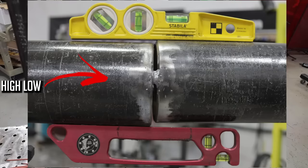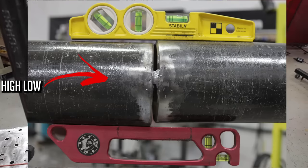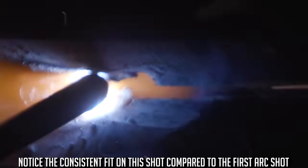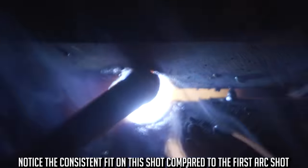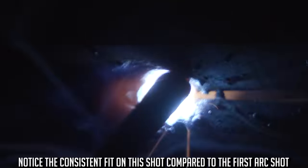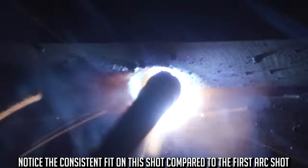Yeah, we fit everything to the inside on pipe. Outside really doesn't matter because we're having something flow through it. Biggest thing with it is just trying to make it the same or as close to the same as possible so you can make adjustments in your machine. You start swapping too many things, as machine or fitment or land, too many variables, you can't maintain consistency and really dial in what you're doing wrong.